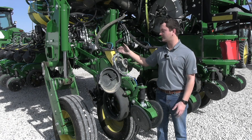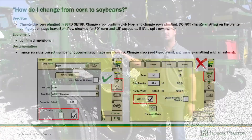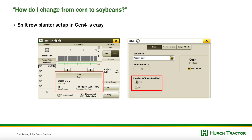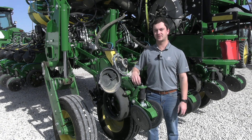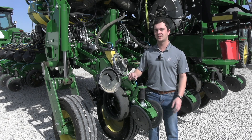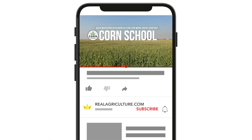A couple of final thoughts on physical adjustments and in-cab settings. If you have a SeedStar 2 or SeedStar XP planter, go into seed setup and change your rows from 16 to 32, or 12 to 24 if you have a split-row planter changing to soybeans. With a SeedStar 4 or newer planter, it's simply easier — change your crop type, check a box, and the in-cab portion is complete. Those are our top five customer calls in the spring. Hopefully this helps you get prepped for planting corn and changing over to soybeans, and if you have more questions, we're always here for a call.